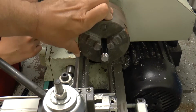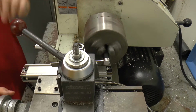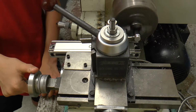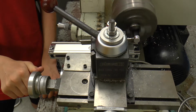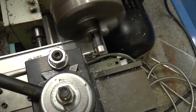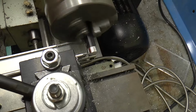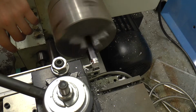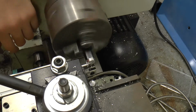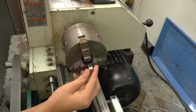That's right. So you can swap tools to the snap ring tool now. Okay, there we go. Zero it out. Got 10. Now about another 8. About here. Let's take a look. A little bit more than that. You want the left side of the tool to be about 1/8 of an inch past the right side of the groove. About there. That looks pretty good. Good. There you go. Perfect.